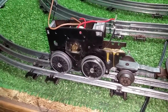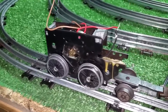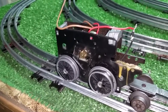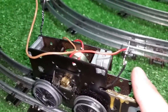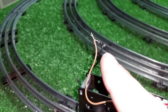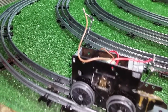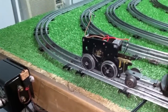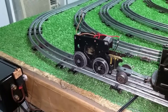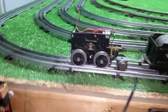Diodes, of course, are called semiconductors. The reason they're called that is because they only conduct electricity in one direction. I've got one diode facing this way on this side, facing this way on this side. So we're effectively converting AC into pulsating DC. To do this correctly, you need two diodes and at least one capacitor, but in this case this is good enough for the test.